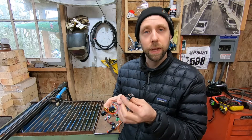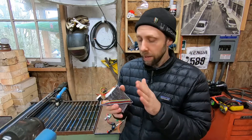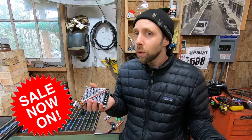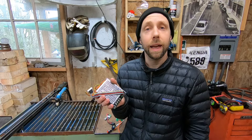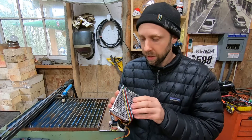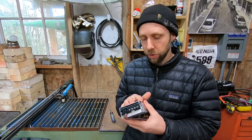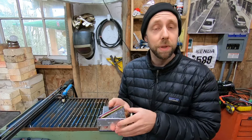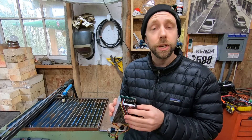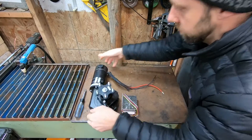This one's cool because it has a little digital display — it might be one more thing to break, but I haven't had a problem yet. I just started running this one on the track torch. It has an on/off switch built right into the knob for varying speed, plus forward and reversing switches, which we'll be tying into for the limit switches. They're in the $20-something range, so it's not going to make or break you to keep a spare. They come in a nice little box case, so you can mount them or drop them in an electronics box without worrying about exposed contacts.